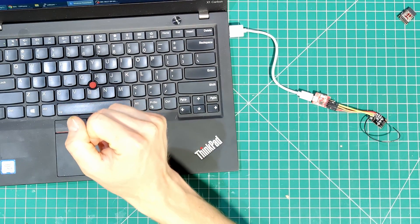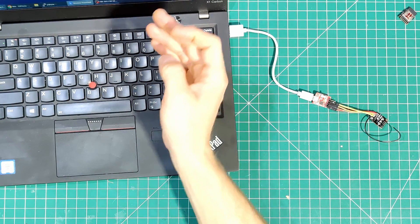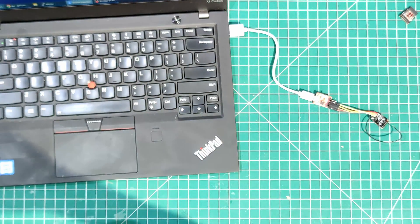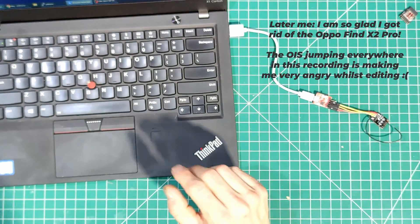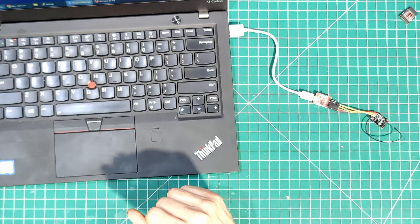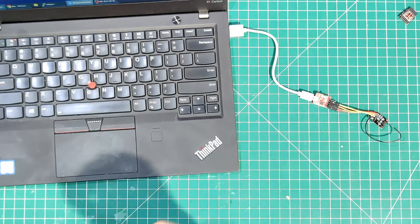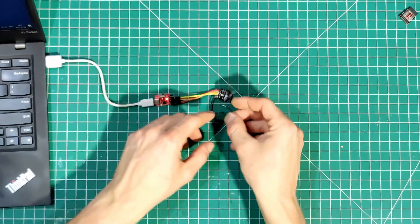That's flashing now. I've downloaded this in legacy format — it should work with both. Most of the instructions now say to use the modern format, however it seems like these ESP32C3s aren't liked by ESPHome web. That's perfectly fine, we can flash it here. One thing to remember when you plug in the UART connections or the headers is to make sure you're in 3.3 volt mode. I've got a CP2104 that I got from Maker Fabs — I'll put a link below. There are ones from FTDI and others, but I find this one most stable.